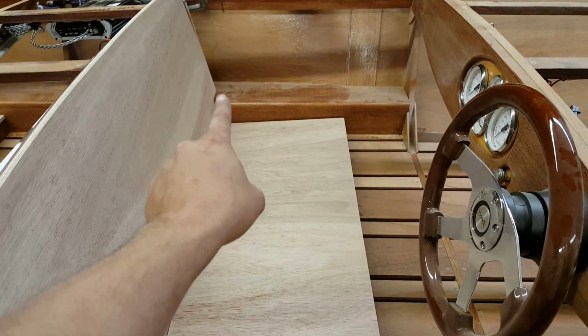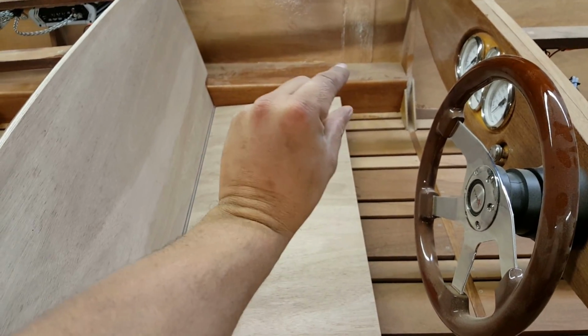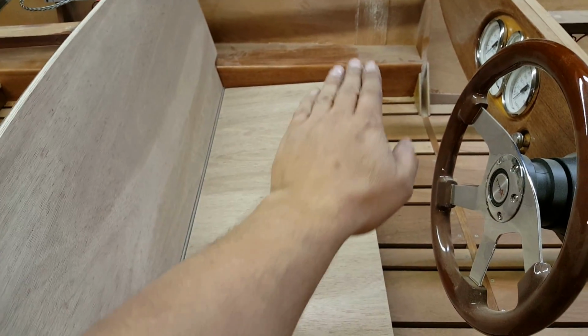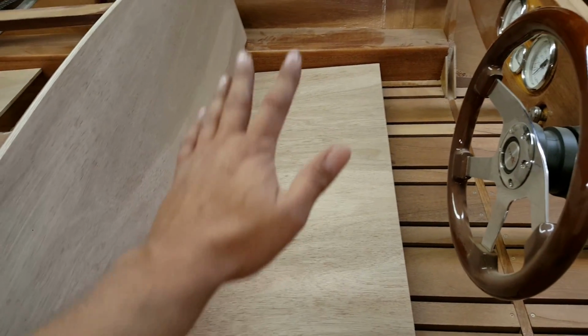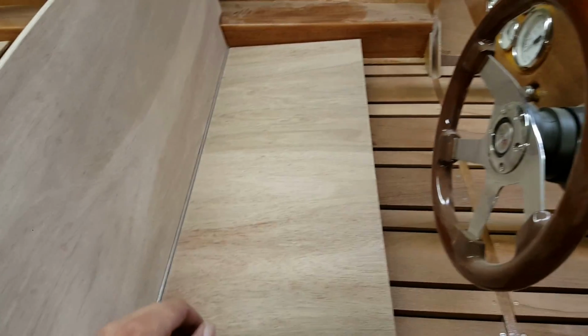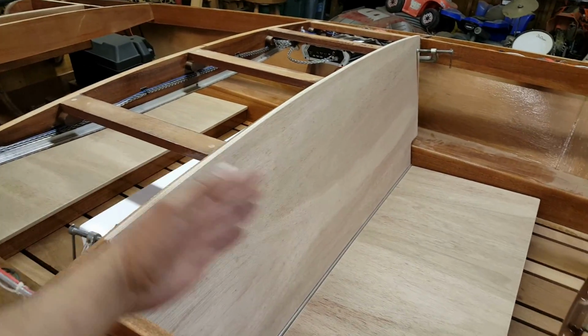It's about 3 inches deep at the top. It's about 2 inches deep at the front. So when I put that 2-inch high density foam on there, it'll be flush at the front and 1 inch low at the back. So this will be covered in 2-inch high density foam. I'm going to pick up the foam to glue to the bottom, the ply. And then I've got to decide if I want to do 1 inch or 2 inch on the back.